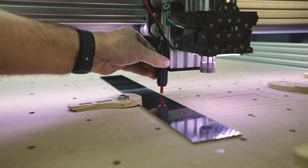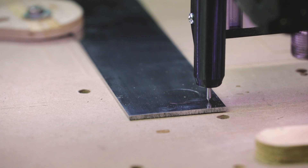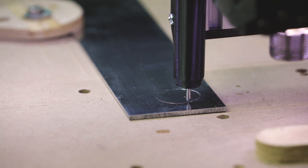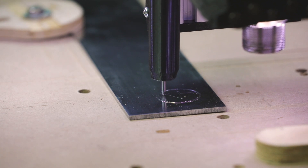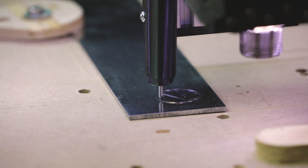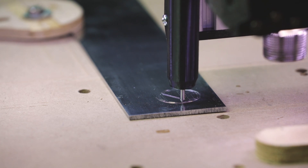After fastening securely to the Z-axis, you can see that I start the engraving bit in a compressed state. It's really important to find the zero point so I know how far the diamond engraving bit needs to be pushing down into the aluminium stock. It wasn't perfectly perpendicular to the spoil board, so it was slightly off on the first pass. I did restart that and pushed it a little further into the aluminium. Just a reminder that it'll only push in as much as it can — the more pressure you put on the diamond bit, it didn't really change the width of the line.